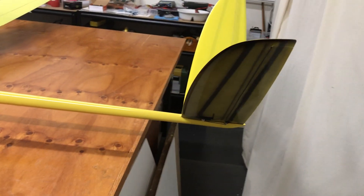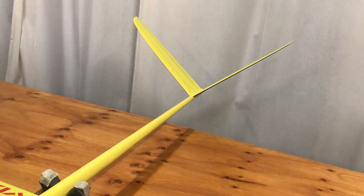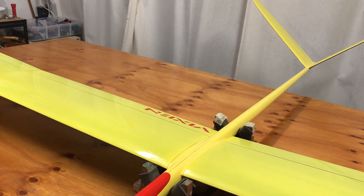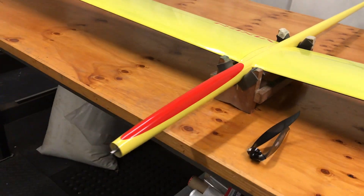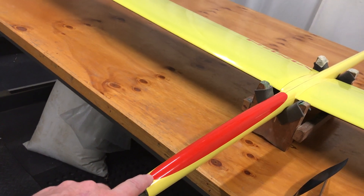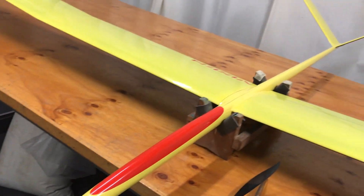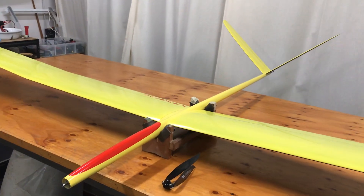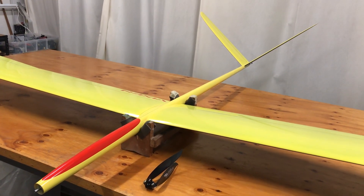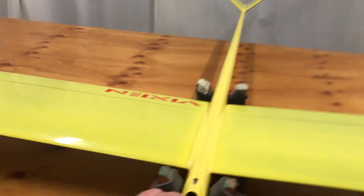So I've got positive, negative, and two signals. I had to put the servos in the back purely from weight and balance — knowing this plane was going to be over two kilos, and it is, just under 2.1kg. Knowing it needed a fairly decent power plant, the motor and gearbox in there is 127 grams. I put it on the balance and knew I wanted a CG of around 105mm, and to achieve that I had to put the servos up the back — otherwise I'd have been adding dead lead tail weight.